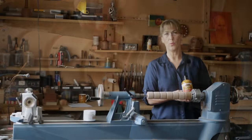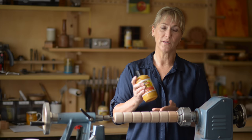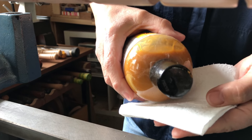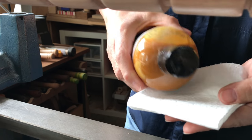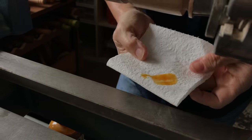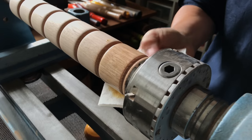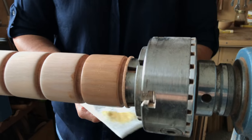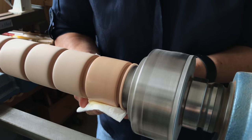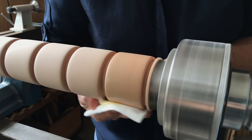Now that I've applied the Triple E wax paste, it's ready to have the friction polish put on top. This U-Beaut product is Shellawax Glow and it has got a bit of shellac in it. Don't put too much — if you put too much it will streak and blob and you'll basically have to cut it back and start again. Put a little bit on the paper towel, spread it out, and apply it to the piece by hand like we did with the Triple E. You need to work fairly quickly with Glow and keep moving the rag or paper towel around, otherwise it will start to grab or pull.